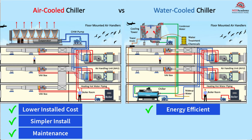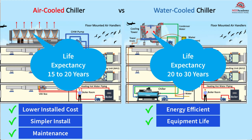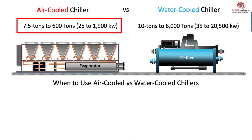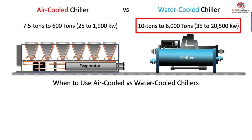Water-cooled chillers usually have a longer equipment life because they're mostly installed indoors, while air-cooled chillers sit outdoors exposed to the elements. Water-cooled chillers have a life expectancy of 20 to 30 years, while air-cooled chillers is around 15 to 20 years. Another consideration: air-cooled chillers only come up to a certain size—some manufacturers offer 7.5 to about 600 tons (25 to 1,900 kW)—versus a water-cooled chiller, which can become very large: 10 tons to 6,000 tons with some manufacturers, 35 to 20,500 kW. Each manufacturer differs.